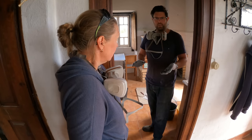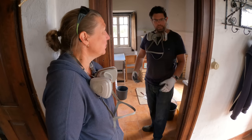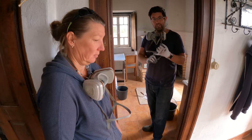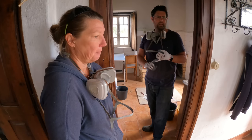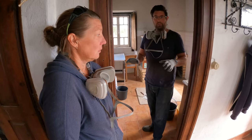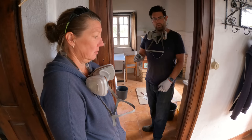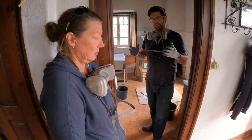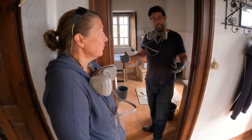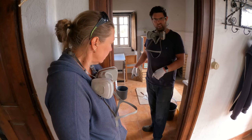And I don't know if Kylie mentioned, because I was quite focused on my task, but the reason that we're wearing all the PPE and taking this very seriously is because this quicklime is a very, very caustic substance. If you get it in your eyes, it's very, very bad. If you get it on your skin, or breathe it in, it's very, very bad because it creates a really strong chemical reaction with water. It generates a lot of heat. That's one of the reasons we're doing it in here on the concrete tile floor.